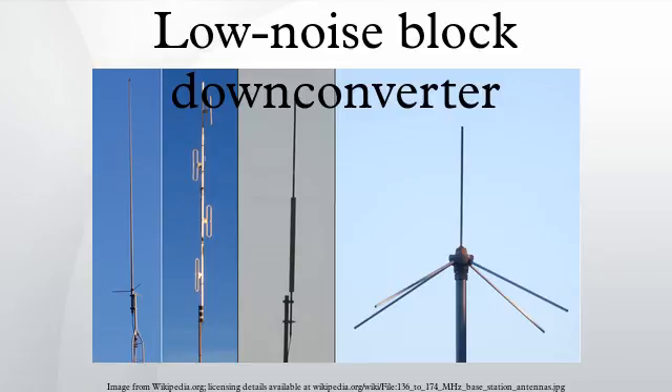SCR or Unicable LNBs: multiple tuners may also be fed from an SCR or unicable LNB in a single cable distribution system. A unicable LNB has one output connector but can feed multiple tuners daisy chained along a single coax cable. Instead of block down converting the whole received spectrum, an SCR LNB down converts a small section of the received signal, selected according to a DiSEqC-compliant command from the receiver, to output at a fixed frequency in the IF. Up to 16 tuners can each be allocated a different frequency in the IF range, and for each, the SCR LNB down converts the corresponding individually requested transponder. Most SCR LNBs also include either a legacy mode of operation or a separate legacy output providing the received spectrum block down converted to the whole IF range in the conventional way.